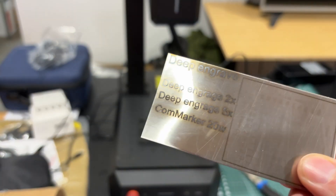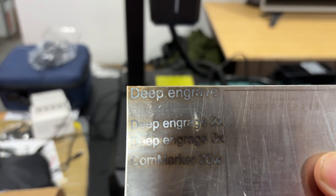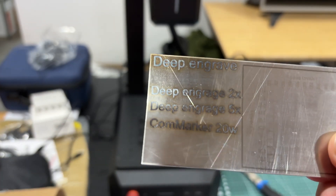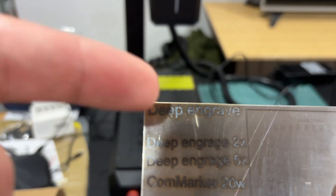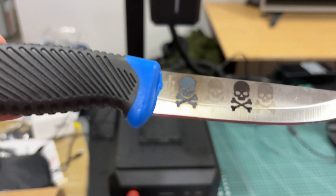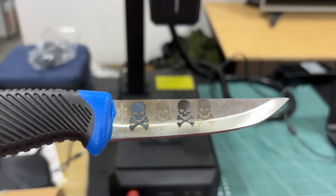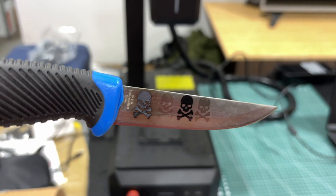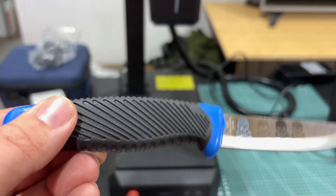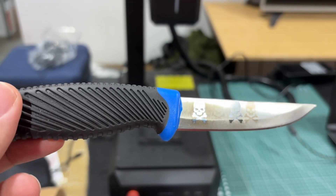That's why I used this welding coupon, because I did get it too hot when I was trying to work on my settings. You can see where that goes — these first two were doing pretty good, the third started to warp it, and then the fourth really warped it. Some of that was because I was going through it without letting it cool down. But I could have got a pretty good effect with the first one. As you can see, coming over to this stainless and doing all four together, I started to get much better results as I got a feel for the machine and the settings. Every machine is going to be slightly different, so always worth practicing. I'm pretty happy with those results, and I've already saved those settings in Lightburn so I can reference them later.